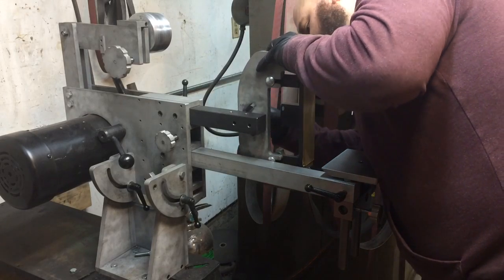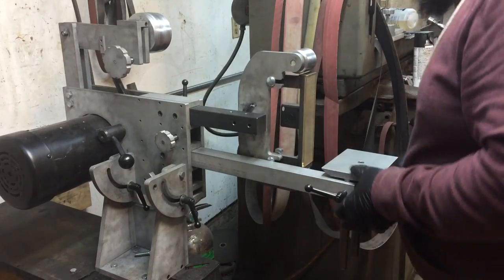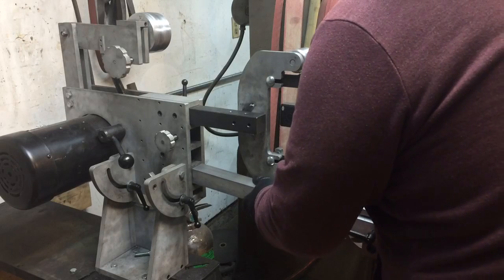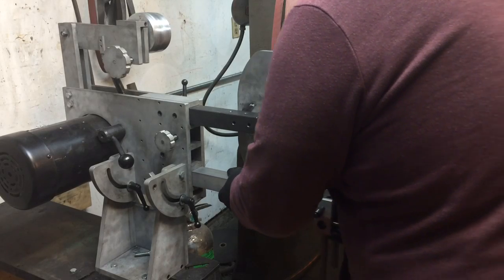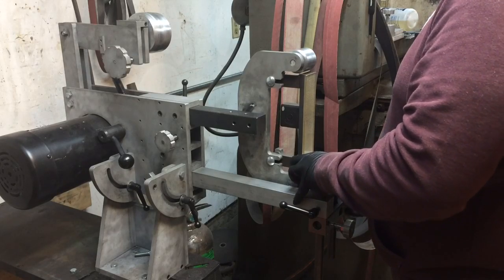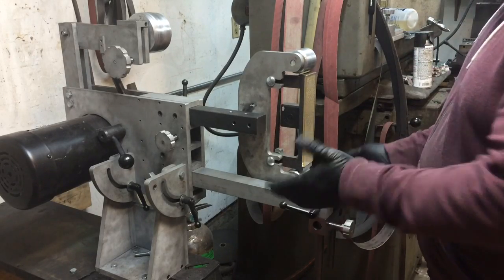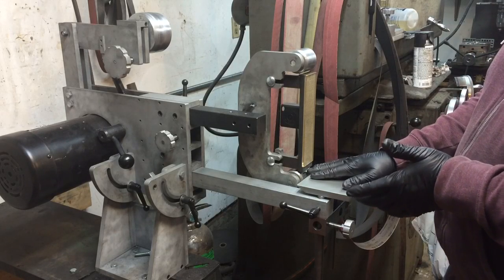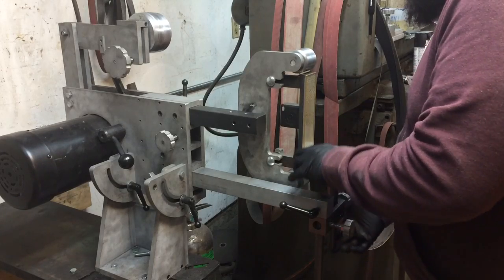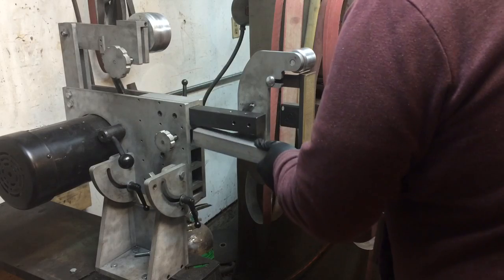Just rough-setting our zero on the platen here — right now we're in the third tool arm position. When you get access to the entire platen, drop down to the fourth and tighten our handles. Right now I've got all eight inches of glass and I can lower it down even just a little bit more if I want to get into this little slack belt area here.